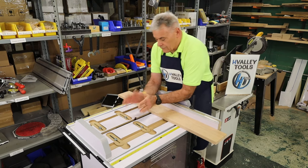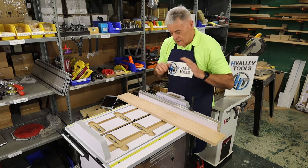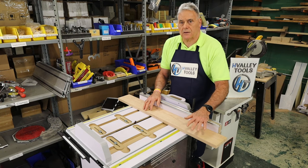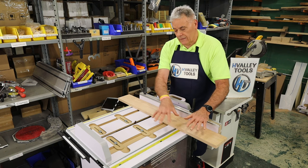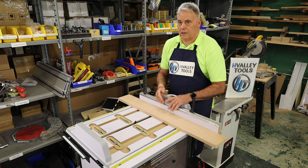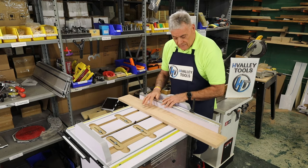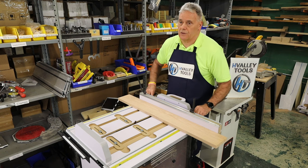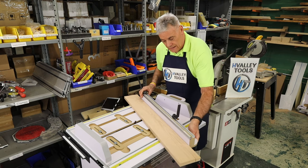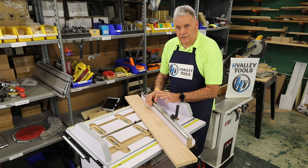The nice thing is that you can use this for a lot of different bits and profiles. You could create flutes, any kind of plunge profile — it just works great. I've used this for some joinery bits that are really difficult to do on a router table and it works really well. That's where having the fixturing of the clamps really makes an advantage. A finger joint is just a nightmare to cut on a router table — it's a dream on this. You just cut the end, cut the other end, done. It's got a lot of applications. You could also do a stepladder type of shelf: just slide it to the angle you want, cut it, and now you have a stepladder dado. It's really neat, a lot of fun.